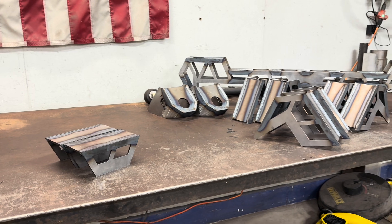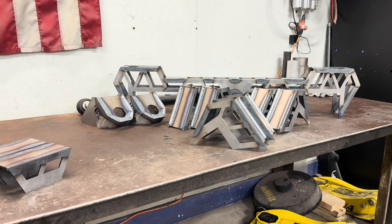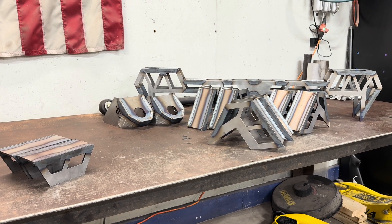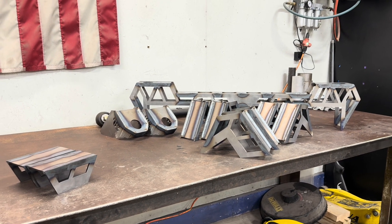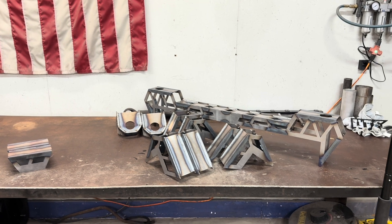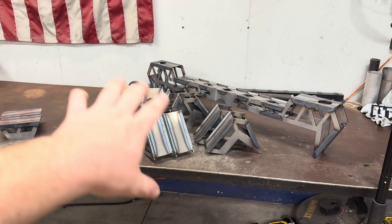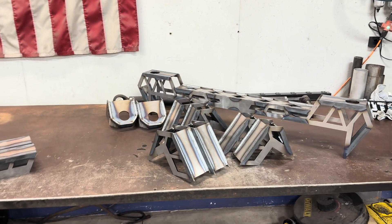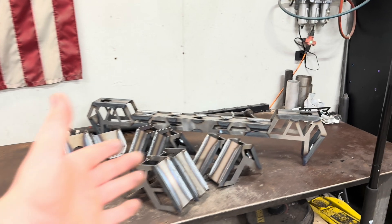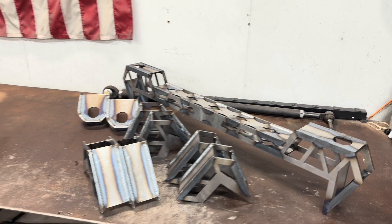I just made minor modifications to the kit I'm running on my truck to make them more universal for you guys. Obviously, these will not be a direct bolt-on fit. Don't expect to get these shipped to your house and just glue them onto your frame and have everything drop on perfect. If you're doing this type of build where you're putting an old body style truck on a new chassis, I'm assuming you have some mechanical ability. You're going to have to grind and fit and cut and make everything sit level for your build. But this will get you a very good head start and get you really close. And they're set up for the Super Duty mounts, so you're able to put a really nice bushing underneath your cab and get a really good ride out of your build.